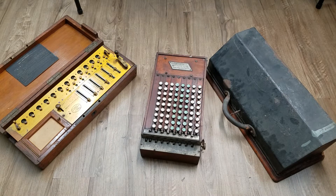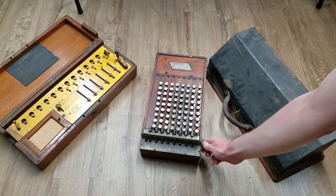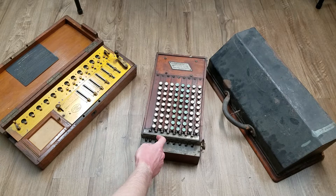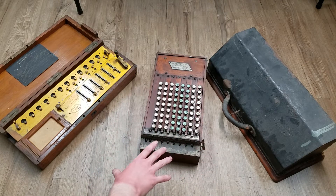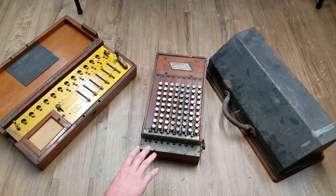Clearing on the comptometer is a little simpler than the arithmometer — you don't have to lift anything up, but you push this little lever down and turn this knob until it locks and everything goes to zero. For decimal indicators on the arithmometer, little pegs go into holes to mark the decimal point. On the comptometer, it has little flip tabs that you can flip up or down to indicate a decimal point in a particular column. The mechanism inside is mostly stamped steel, with a few machined brass or gunmetal pieces.